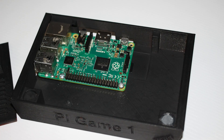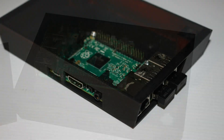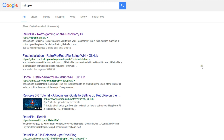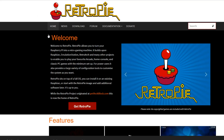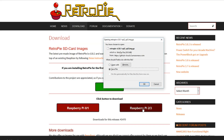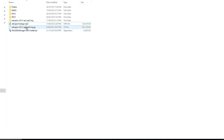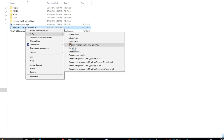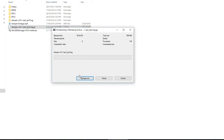Install the Raspberry Pi 2 into your case, screw it down, and get ready to image the SD card. To get the software that we need, just Google RetroPie, jump over to the RetroPie website, click on the Get Software button and download the image for the Raspberry Pi 2/3. Just double check that it's for the 2/3 and download that to your computer. Once you've downloaded it, it's a compressed file, so unzip it to a folder and make sure you know where that is so you can get to it later.